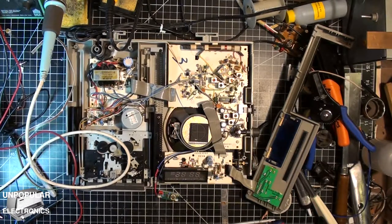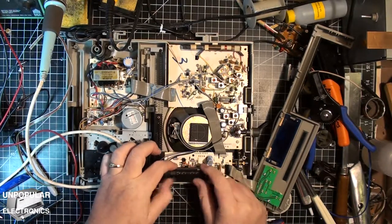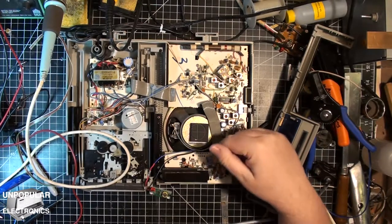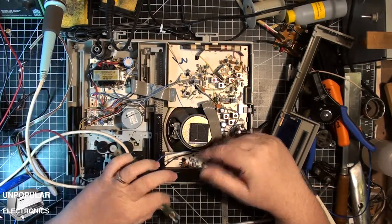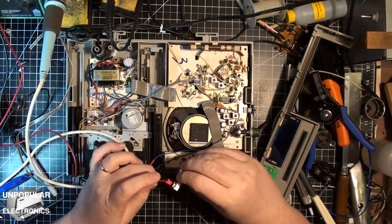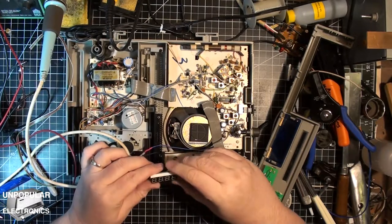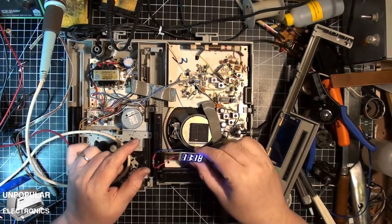What I'm going to do — I've already done some work here. On the bottom I've connected two wires to this capacitor, and this is giving me about 15 volts. I'm running that through a 390 ohm resistor, which is dropping it down to around 7 or 8 volts, which the tiny little voltage regulator on here can handle. With this powered on, it works.